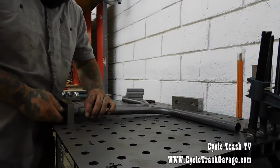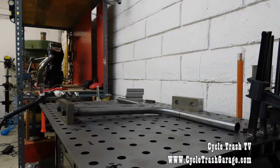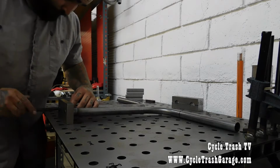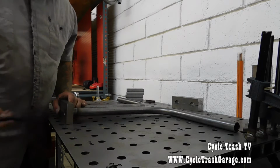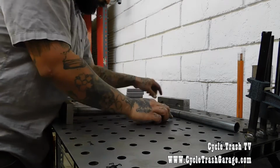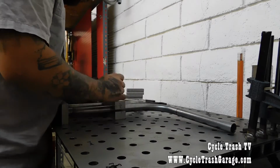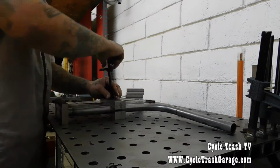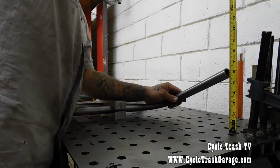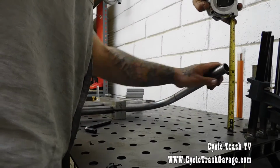So here I'm putting them in the jig. For these bars, they sit on center 3.5 inches. You can directly bolt these to your bike and set them up how you want to do them, and then weld the centerpiece on them, or just have two pieces and make sure you tighten down that bolt really tight, and then you have your bars. This jig I bought off of Lil Chopper 74, I think his website's like Gorilla Fabrications or something like that. I'll try to put the link below.